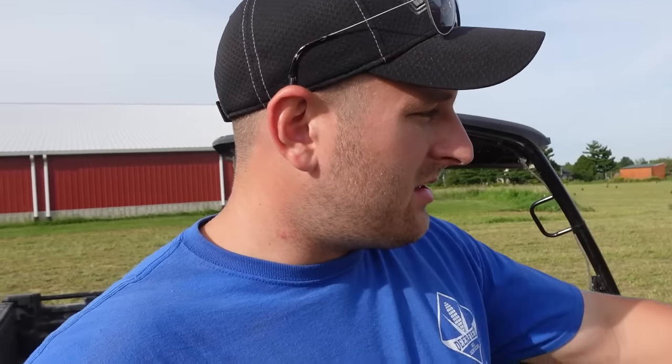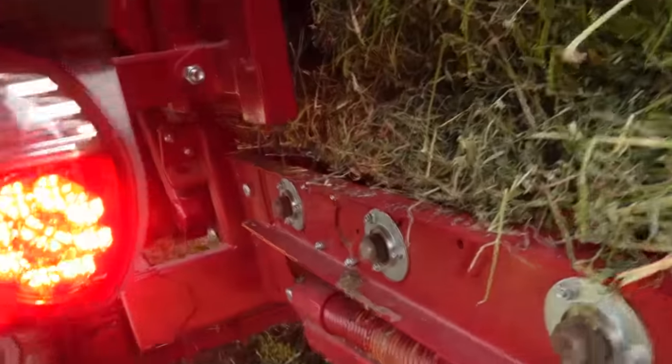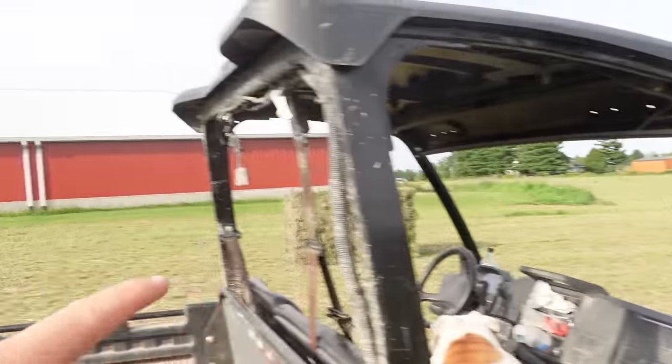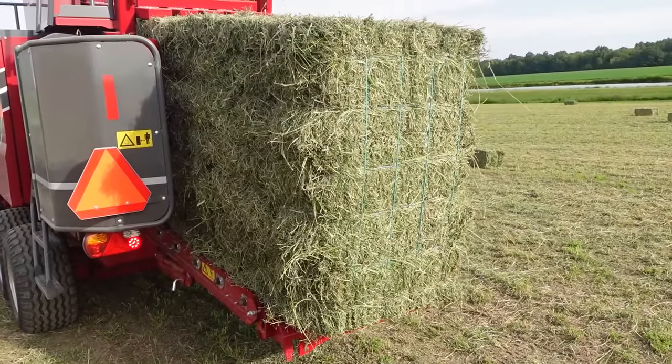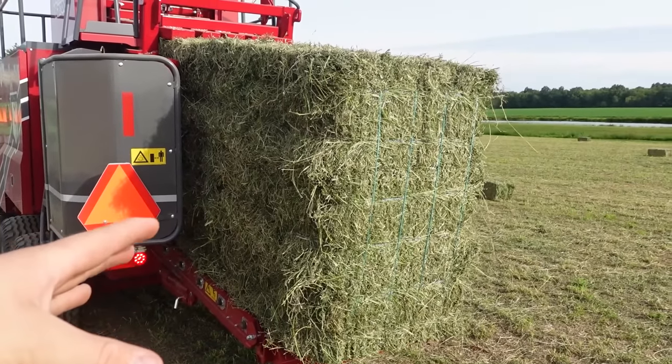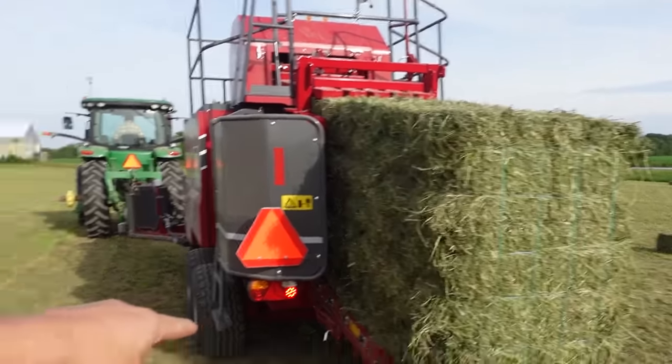In my amateur ignorance, I forgot that we had lifted up the back roller table that the bundles slide off of. I should have taken this adjustment on both sides and put it in the elongated hole so there's some bounce and compression with the springs. The reason it's up is because when we're backing into one of our barns, it's raised a little higher so we're not worried about scuffing the bottom. If we had the kicker on the bottom pulled out and it was flipping the bundles sideways so all 21 bales are touching the ground, that's when you run it higher because it needs a little more fall to flip.